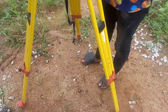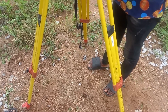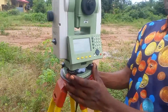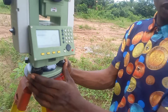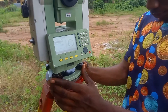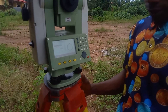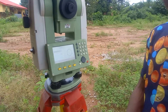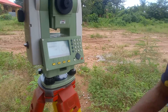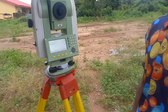It has moved away from the center. Since we are using a laser beam, you make use of the foot screw to make it come to the center, since it is very close to our point. And using the laser beam, you adjust the leg of the tripod for leveling.